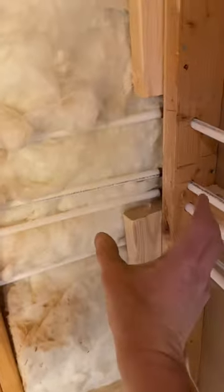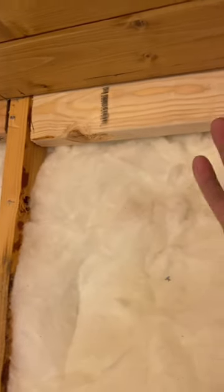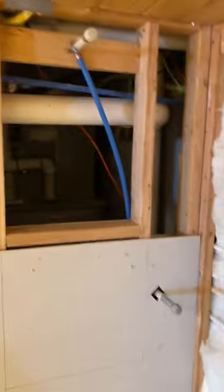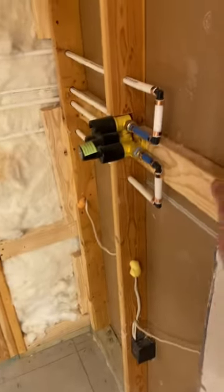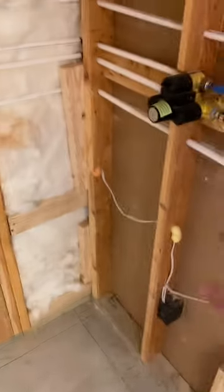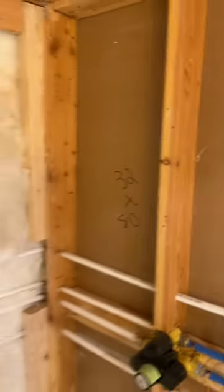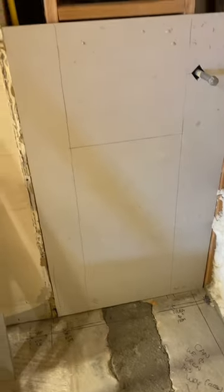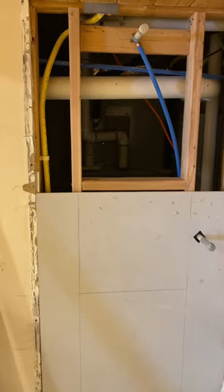I've got a little bit of framing done. I always like to put corner blocking in if there isn't any — this is just to have something to staple my lath to, same with up here at the top. I don't like that lath flapping at the top. Once the mud dries, that blocking is irrelevant — the mud basically becomes its own structural unit. I need to fur out both of these sidewalls a half an inch before I float because we're doing an inch-and-a-quarter thick mitered return detail. Rather than just nail some strips of half-inch material on there, I have some go board scraps here I'm going to screw up. They don't have to be perfect — it's literally there just for backing. That'll actually save me some mud on these two sidewalls, so I won't really need to do a thick scratch coat. I'll hang lath right over those and float the whole shower.